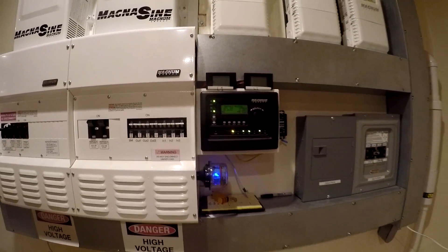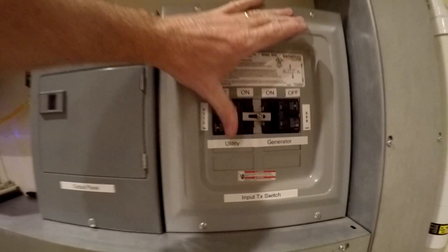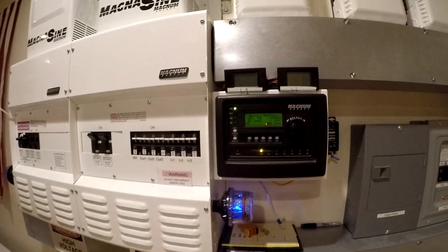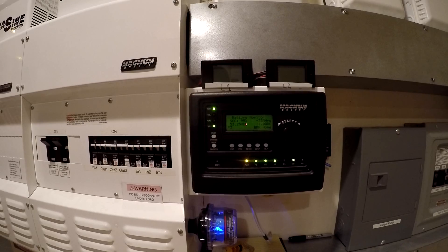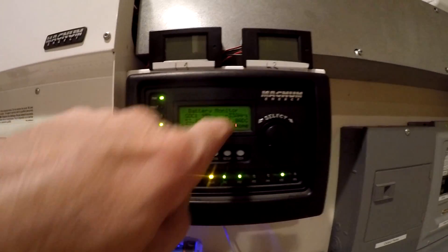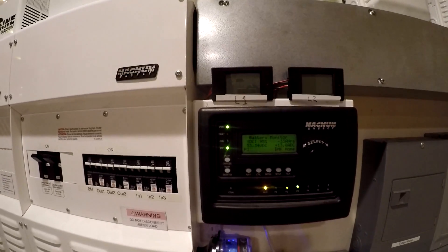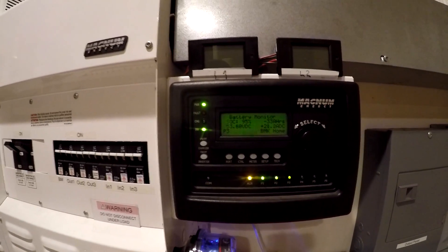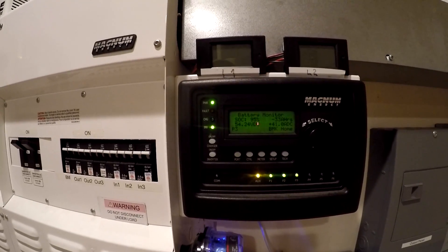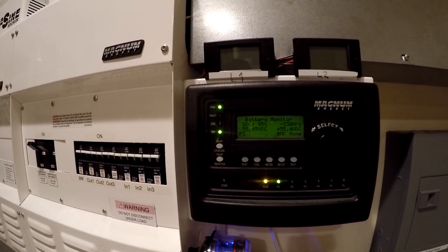There's one more thing I want to show you. That was charging off the generator, but I can also charge this off the utility. To do that I just come over here — it's a 60-amp breaker, maybe 55, off this sub-panel — which comes over to here. Just like the generator's on this side, I can pop the utility on that side and we're going to do the same thing. It's going to qualify the utility and crank those chargers up — now we're pulling off the utility. The amps will ramp up in a sec. As long as you still got power you can charge off the utility. I've only done this like three times just for demonstration — I've never actually charged this bank off the utility. I have enough generators that need to be exercised once every two or three months, so whenever I need to I just use those. But that is utility charging batteries.